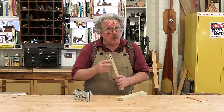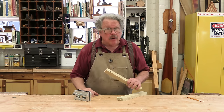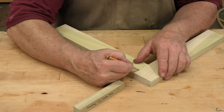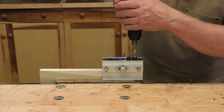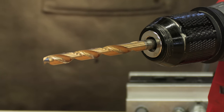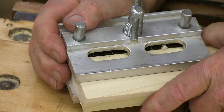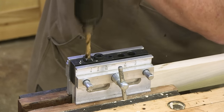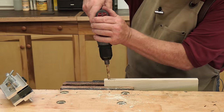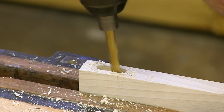But this jig will do more than just poke two holes. You can cut slots between these holes and the slots will line up just as accurately as the dowels. Mark where you want the holes that will mark the beginning and the end of each slot. It helps to know the exact distance between the two holes in your jig from center to center. Drill the holes with an ordinary twist bit — I find a bit with a low angle point about 118 degrees and a short spiral around 36 degrees works best. Use the stop collar to control the depth if you need to. Loosen the jig and move it about half the diameter of the hole to the right or left. Drill another hole to remove some of the stock between the end holes. Repeat until you've roughed out a slot between the two end holes. Remove the jig and place the drill bit in one of the end holes, turn it on and angle it back and forth, letting the flutes cut and smooth the sides of the slot. Move the drill to the other end hole and repeat.